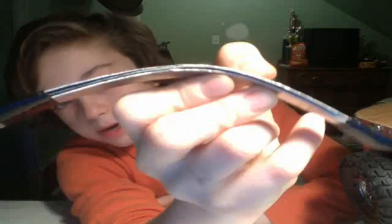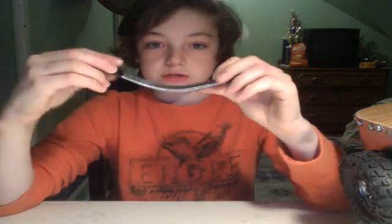And I also made these, which are leaf springs. The same stuff I made those sandboards out of, just layered and thinner. I mean, not as wide. And they're held together with electrical tape right now. But to make them leaf springs, I just have to heat them up red hot with a torch, and then take a vice grips and grab them, because I can't touch it with my hands when it's red hot, and dip it in oil, and that will make it stay hard. So that way, if you hit a bump, it won't just stay bent, it will spring back. I made 2 of them, because 2 wheels.